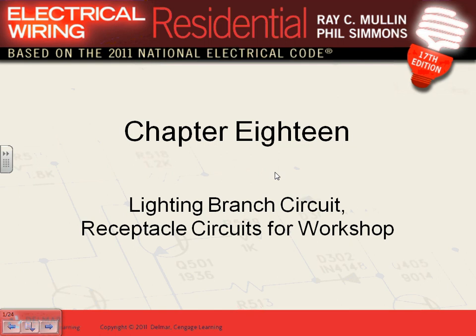Chapter 18 talks about a room in the basement — one area they're calling the workshop. One thing you have to understand about this workshop is it's an unfinished part of the basement. If it's unfinished, it doesn't matter what you call it — you don't apply the 6/12 rule, the two-foot rule, and all that on an unfinished part of a basement.